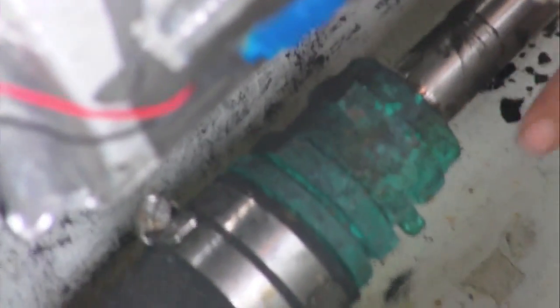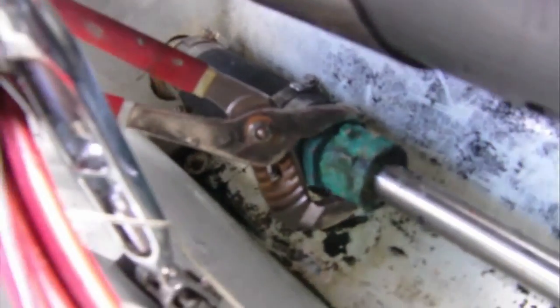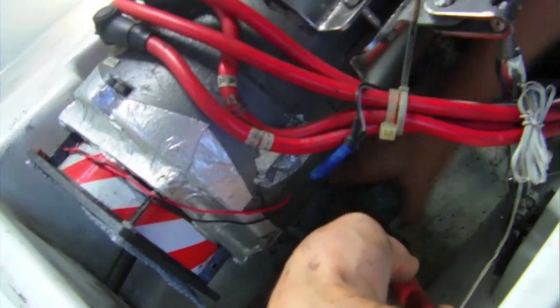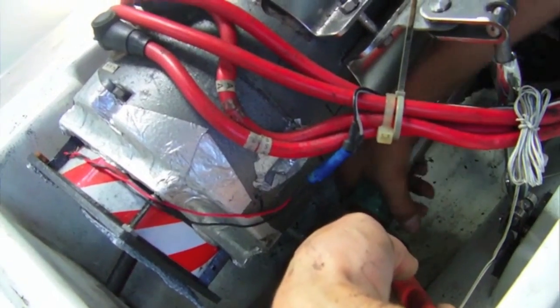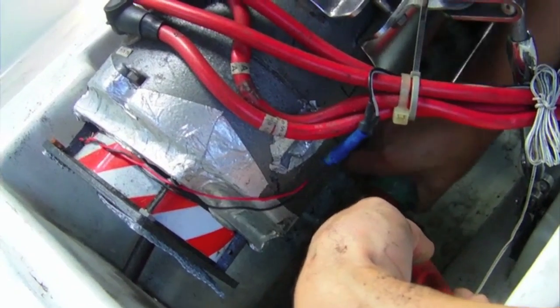Today we are going to repack a small stuffing box on this 21-foot electric drive boat. The first step is to open the existing packing box. We recommend using a large channel lock pliers on the fixed end of the stuffing box while unscrewing the compression ring. This can sometimes be done easily by hand, as shown here.